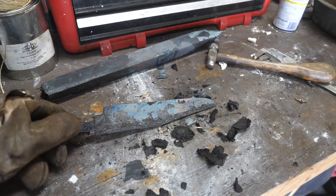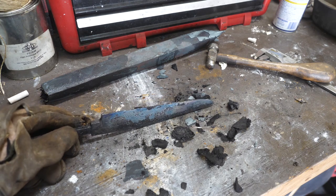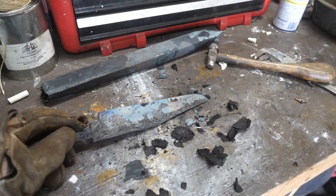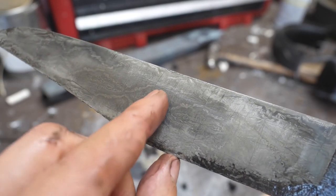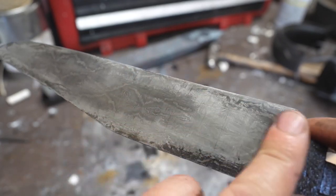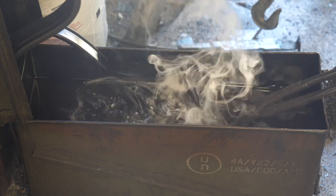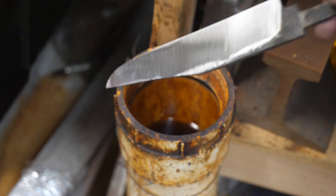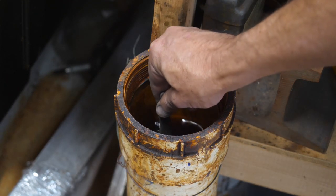Isn't that pretty — sort of like color case hardening; I think it's a similar process. I'm going to get it cleaned up and etch it. There's still a hint of a silver line there; the rest of the lines did turn black though. The blade was normalized at 1600, then 1550, then 1500 degrees Fahrenheit, then quenched from 1490 degrees, and ground down further before checking it in the ferric chloride. That's not great.